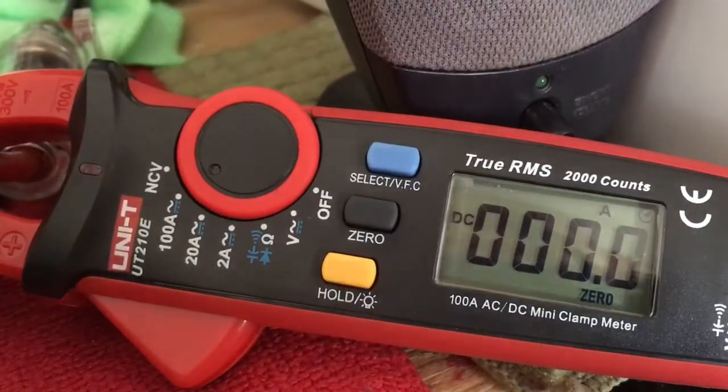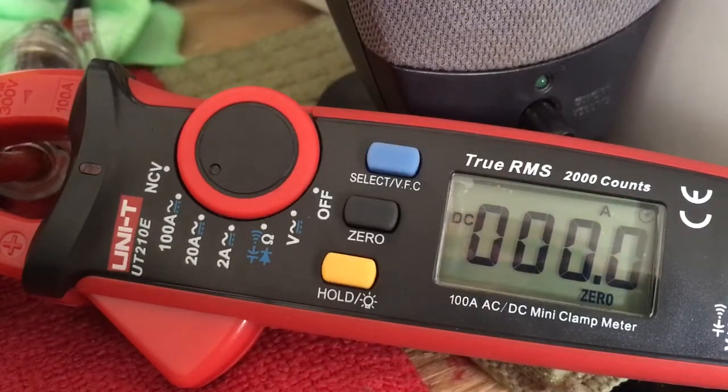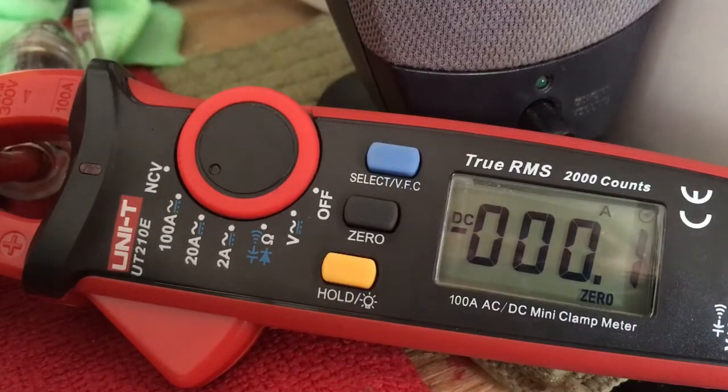DC Amperage on the Ranger N2, dead key: 26.9 Amps drawing on dead key AM. Audio check — a little over 26 Amps DC Draw on AM. This is coming off of our 100 Amp power supply.